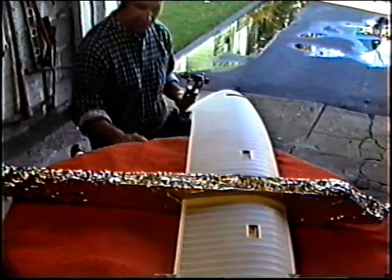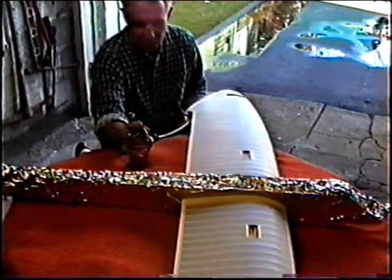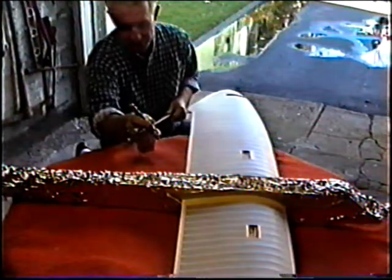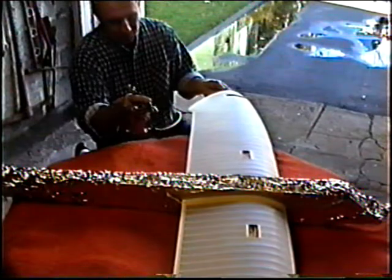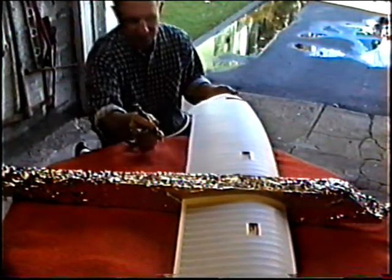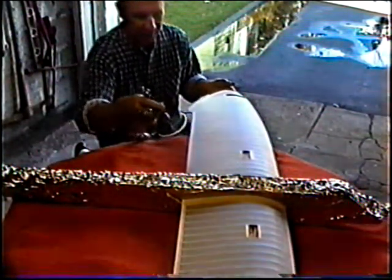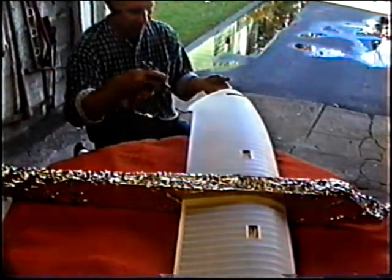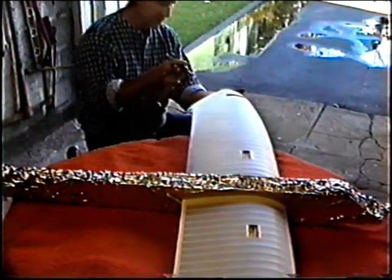I'm still waiting to confirm that I don't have a humidity problem. I'm trying to use 25, I'm down to about 20 here. Even in this cold weather, this material just sprays so nice. Again, you could use a finishing friend. Byron Walker makes a really nice finishing friend. In fact, I have one here. I just haven't had time to set up a little plate for the nose. Before this project's over, I think we're going to be doing that. But I'm so used to just working under a certain type of condition.